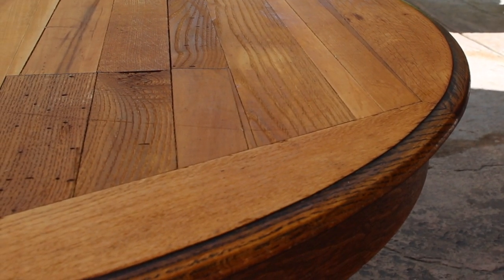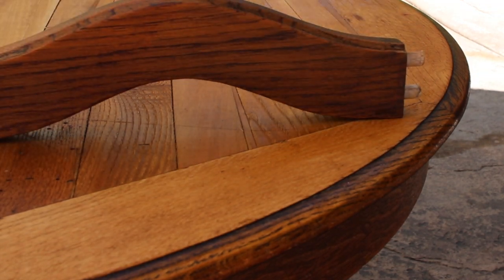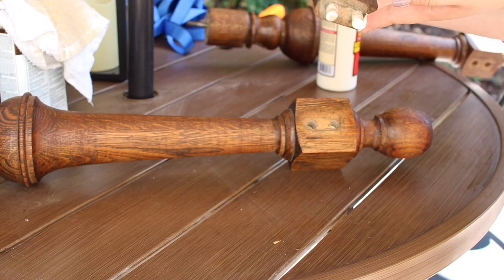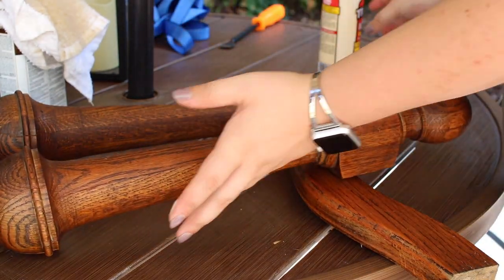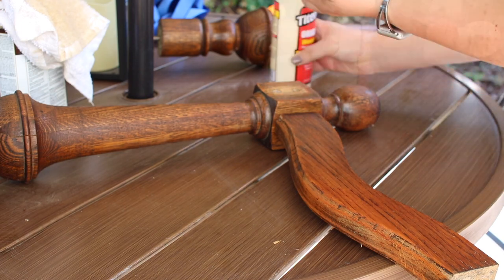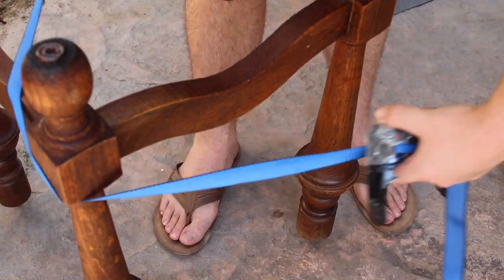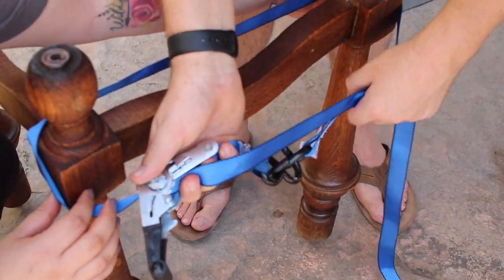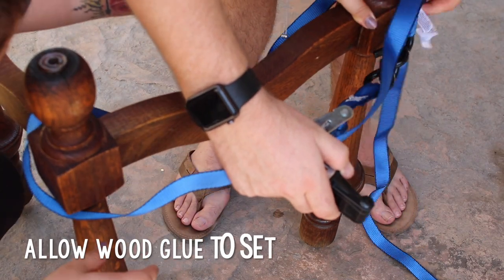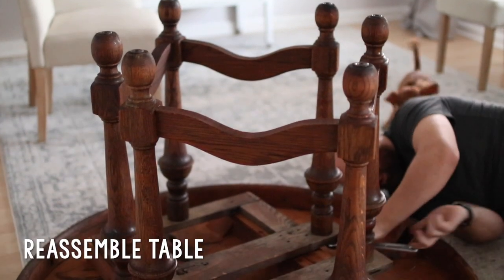As for the finish, I was pretty happy with what I got at first, but as it dried I knew the surface was going to be a different finish than the legs, just like I had predicted. So I moved on to repairing the leg joints. I was pretty worried because once we had taken the legs apart, I realized that if we messed this up, we were pretty much screwed. Thankfully it worked out — it's pretty straightforward. You just cover all the areas with glue, make sure you have enough in there, pop them back in, and wrap them up. We left the legs secured like that for about two days to let everything cure and set, and then we were able to reattach the table legs to the top.